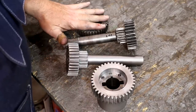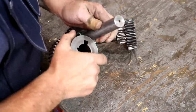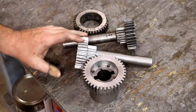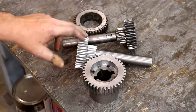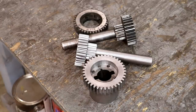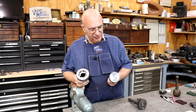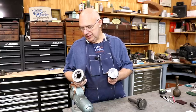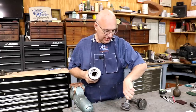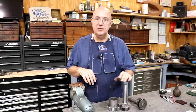One new set of gears — and here are the old ones. We're going to send all this stuff back. These mesh up really nicely — they're all the same pitch so they should all mesh with one another just fine, and they do. These are nice brand new teeth, all ready to go. I think this job is complete. Three gears to replace the old worn-out broken teeth, and we should have nice brand new gears to go back on that drill press and get her back up and going. Another project knocked out. Turned out nice — I really enjoy doing gears; there's something satisfying about cutting out gear teeth.